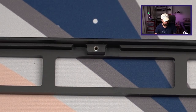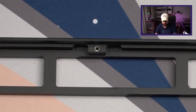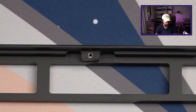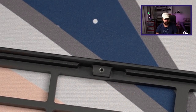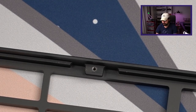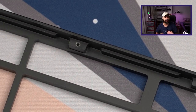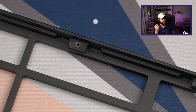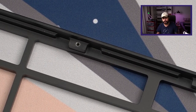So this specifically is why there was glue on the screws. So basically these holes, after being drilled, are filled with a compound to prevent any anodizing from going in there. And honestly, mission accomplished. What I had initially thought is they drilled these after anodizing, but apparently not. So these screw tabs are tapped before the anodizing process. They're just so incredibly clean because of that material that they put in there, which is fantastic. You do want that. That basically means there can't be any potential globs of acid or whatever that get stuck in there and start messing with the screw threads. Pretty cool. I mean, alternatively, you can just tap the screws after you anodize, but I'm pretty sure there's a reason they didn't do that.